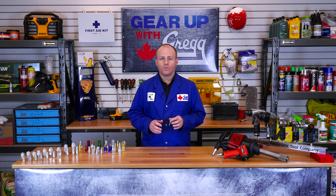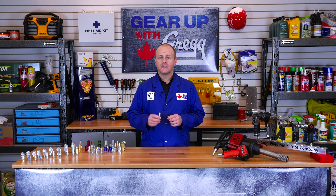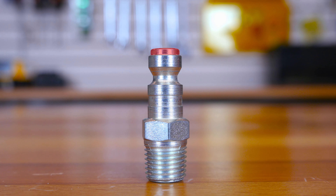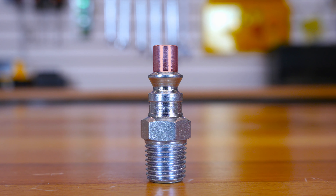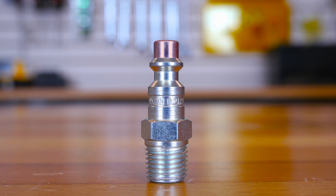On this chart, you will also find the measurements for each plug's tip length. This is the length above the recessed groove where your female coupler would latch. Each style of coupler has their own unique measurement for this part, and some of them can be quite similar. That's why this chart is the most effective and accurate way to identify between various plugs.